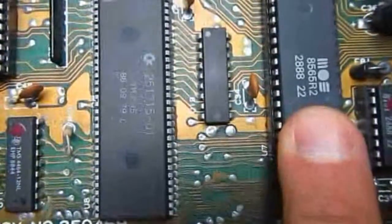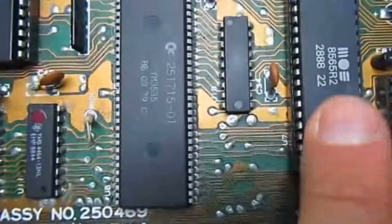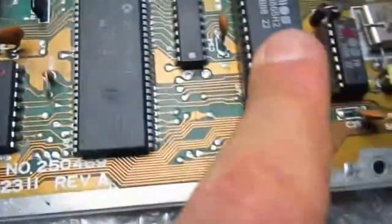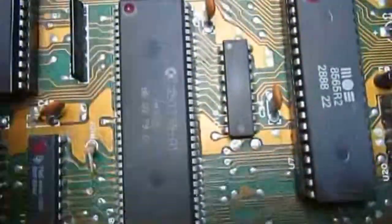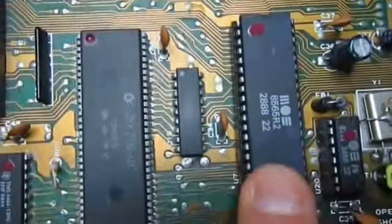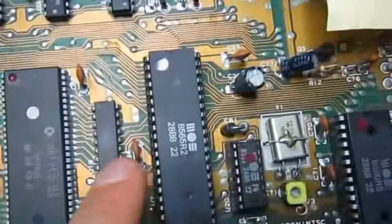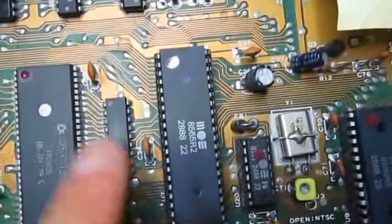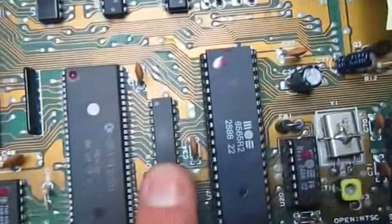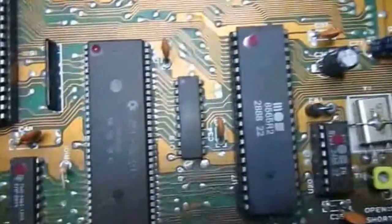I cannot test the old VIC chip in place of this one — they are not very interchangeable because this version runs without the 12 volts. I might change the bus transceiver and the color RAM, but I believe the fault is the VIC. I'll write a little test program myself to read the entire RAM and see. There seems to be more to work on with this one.